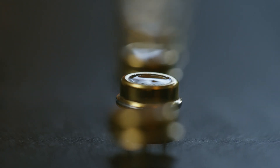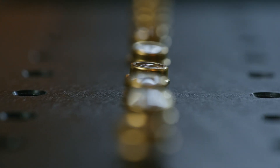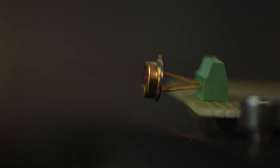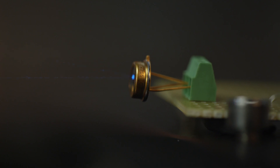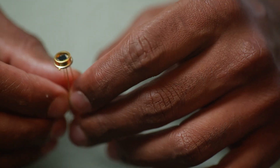On a production line where you have to characterize thousands of components — like a photodiode with broadband optical performance — you need an extremely bright light source to do that. The Chromatune is exactly what you need there, because it is an extremely bright light source with broadband capabilities as well. You can expose the photodiode all across its bandwidth with an extremely low exposure time, which means the throughput of your entire process is going up.